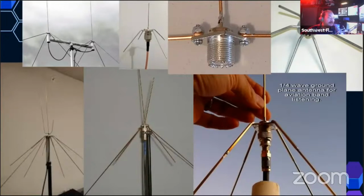That's the hardest part, and it's usually really easy to do on those case mounts because you can just put the center conductor right in. There's usually a little hole. It's really easy to do. In some cases, your wire will fit almost snug down in there, and you just put a drop of solder on there, and you're done. It's really not that hard. In some cases, you might be able to just stick it on there and crimp it if you don't have a solder. But it's always best to solder when you can.